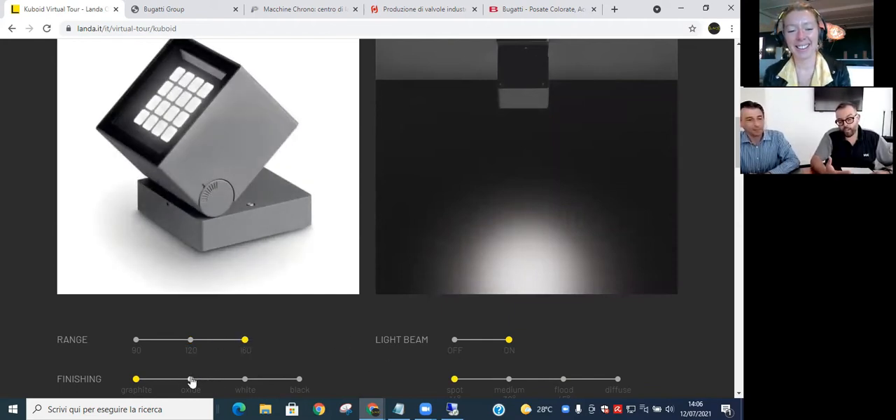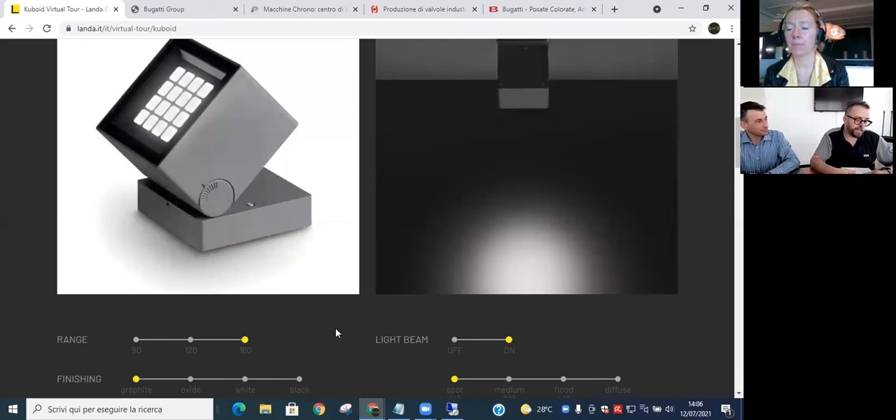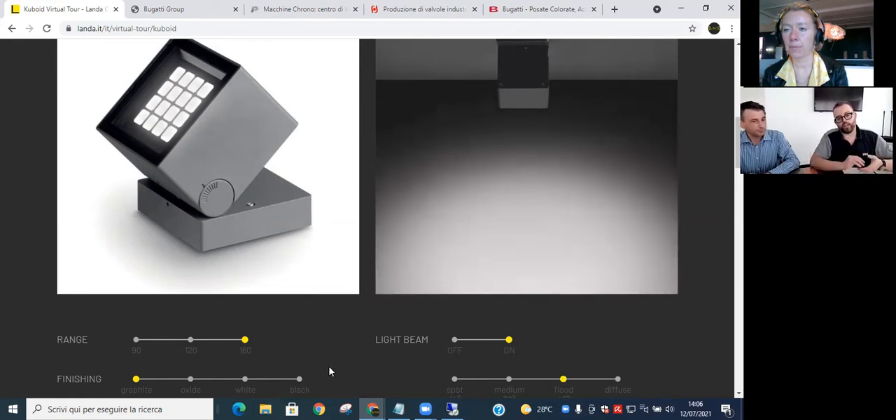Because of the way the product is designed, it's very easy for project requirements — we can play around with the optical solutions within this range. It's a very modular product in the way it's built. If you have specific project requirements — say for asymmetric, very wide, very narrow beam, or grazing effects for wall washing — we can very easily re-engineer this. One of the new ranges coming out in the autumn has this feature where the optics are exceedingly modular and can follow project requirements very closely.